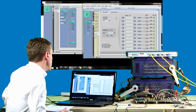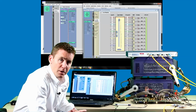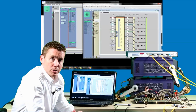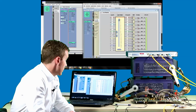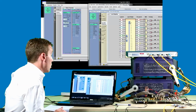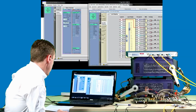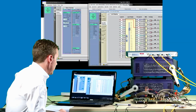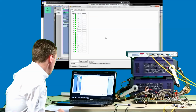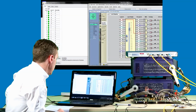Moving down to the OTL layer, I explained during the FPGA architecture that the OTL core has the ability to dynamically reorder the lanes, and we can examine this by using the JDSU box to reorder them on the way in. So if we move this down, we can see the expected alarms and then the design recovering. We can also see the same thing in the Aliathon status interface.